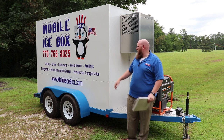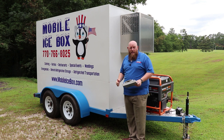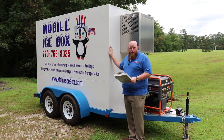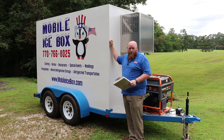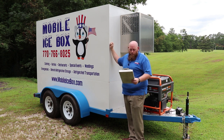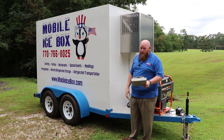Now let's talk about the transport box itself. It's 20-gauge steel with welded corners and a Ceramistar high-performance finish so it looks good even going down the road. It has foamed-in-place polyurethane insulation — plenty of it — so even if it's 110 degrees outside, your product is going to stay cold, or even frozen if that's what you choose. It also features heavy-duty truck-type hinges and a lockable door latch.